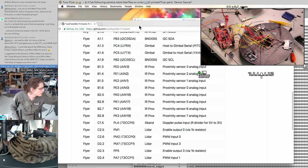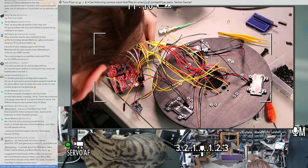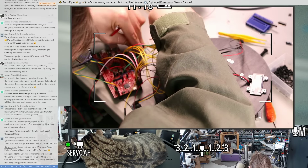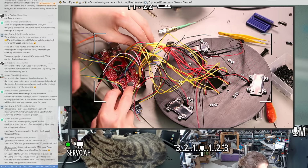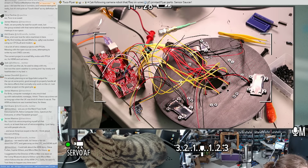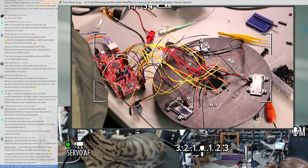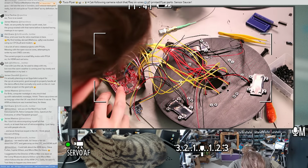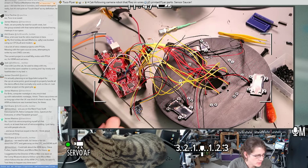Okay, 5-volt power then. This will be powering up all the IR sensors for the first time, I think. I need to increase the current limit on the supply a little bit. The limit is set to 0.3 amps. Let's try a 1/2 amp. Okay, so now it's drawing 0.37 amps, which seems better.